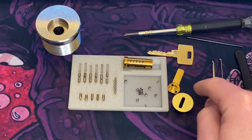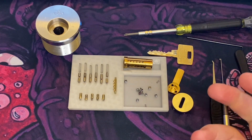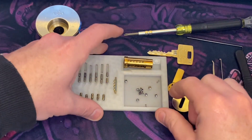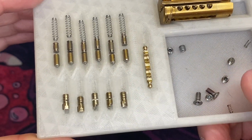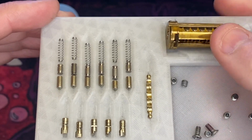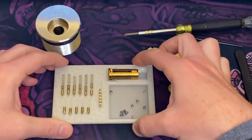As far as what is in this lock from a picking standpoint, it's very similar to something like the Assa Twin Maximum, for example, or kind of like a Twin 6000 with barrels, but the side pins are very different. They're more similar to a Twin Maximum. So I've got this all gutted. You can see here we've got our standard Assa barrel pins there. We've got our sidebar, which is probably very familiar to people if they have ever seen the inside of an Assa Twin series lock before. We've got our matched milling here in the plug. You can see the double lines there for barrel milling. And then the side pins are where it differs from a lot of the other locks.